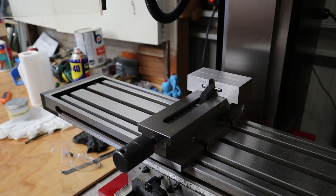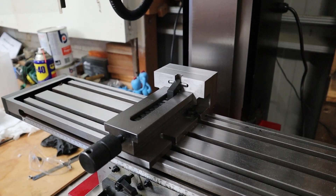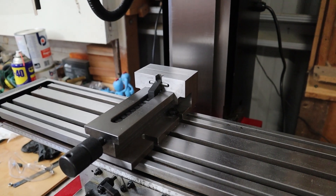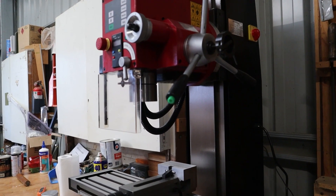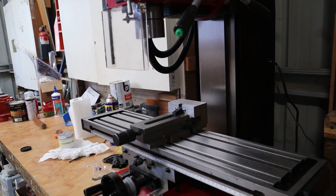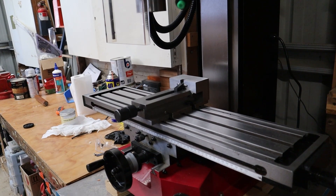The table size is 700 by 160 millimetres and uses 12mm T-nuts. All the slides also have locking knobs to keep them secure. That's a good look at the mill, but I'm sure there are some features that I'm still missing. Let's look at some of the tools and accessories that came with the mill and some that I bought.